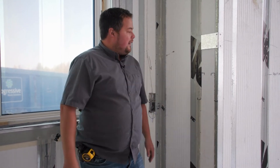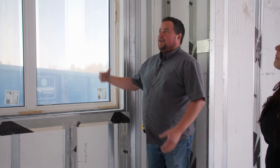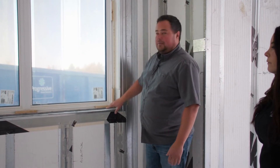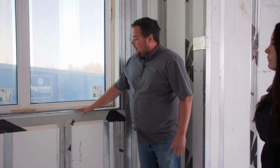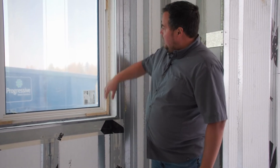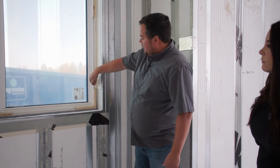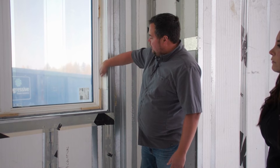Unlike conventional framing where the header transitions through something else. While we're here, we might as well talk about window installation — it's one thing to have a great SIP panel or wall, it's another to have good windows, but installation means everything too. Something as simple as making sure you have a good sub-sill flashing is important, and then sealing around it. We order our windows without the jamb extensions, because if you have a jamb extension it's really hard to get that seal to the outside.